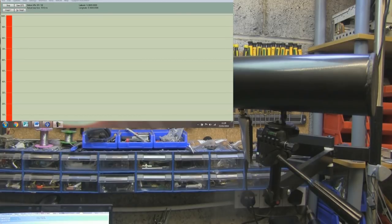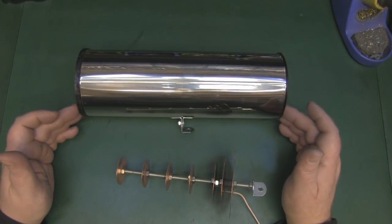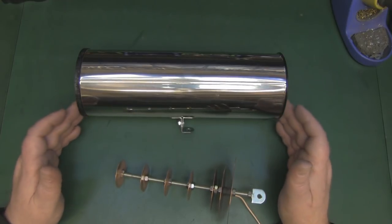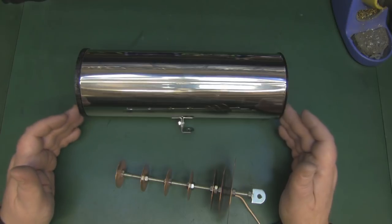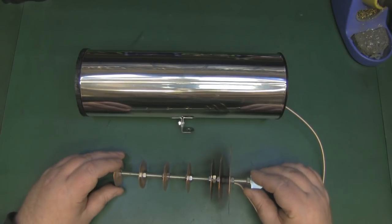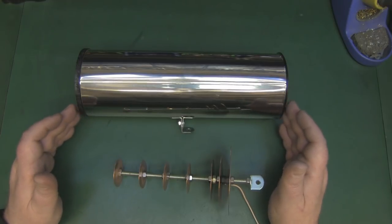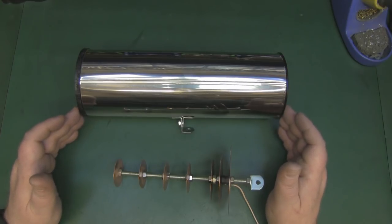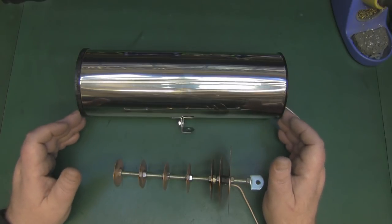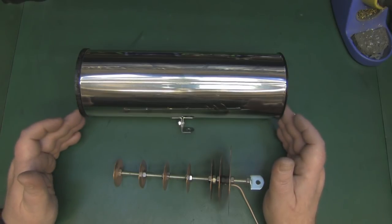You have to weigh up the pros and cons: is it worth the time and effort to build something more complex when a simple cantenna can outperform it? That said, there's more work and experimentation to do. As an improvement over the standalone circular element design, adding the can does give a little more performance — around 10 dB more — so that's a win. I have ideas around element spacing and general shapes, and I'll put the PDF in the description if you want to try building this version.